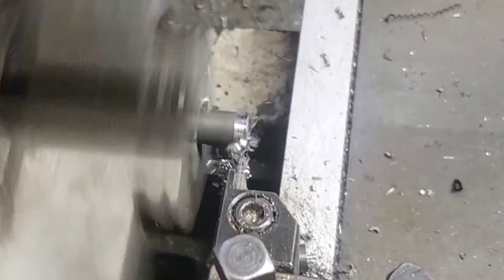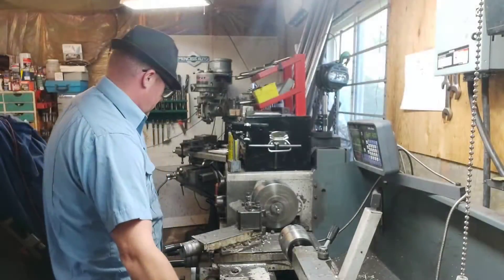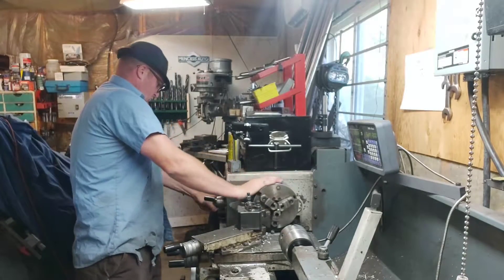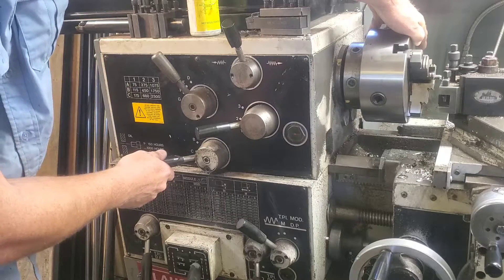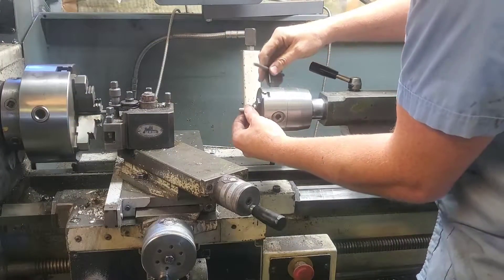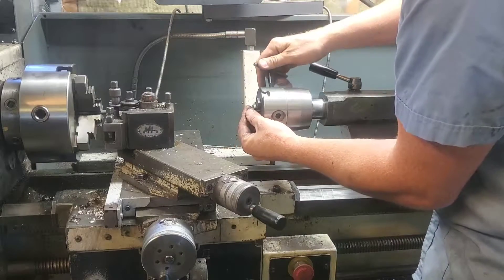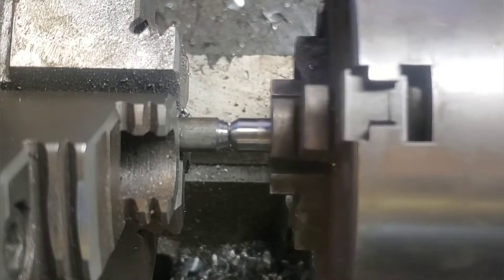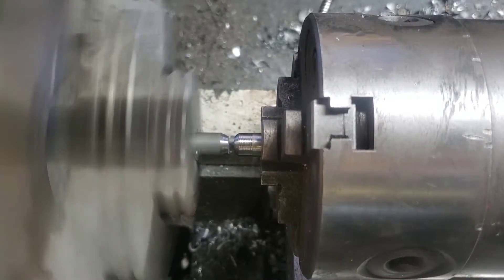You'll have to stay tuned for the next video on that. Now it's going to come down to your feeds and speeds. I'm going to increase the lathe speed to about 1,000 to 1,500 RPM. The lathe has to be really humming to actually weld this stuff together or you're going to be at it for quite a while and it'll end up just eating everything away. This is a bearing chuck that you see me using and I'm actually just going to end up holding this by hand.